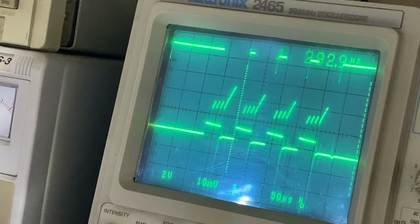So you could do this same modification in the 2000, which this is, the 2100, same power supply, and the 2200 is very, very similar. All you do is find the 40106 near the power supply and tie your transmitter in so it allows it to activate whilst it's transmitting. When the transmitter turns off and goes the other polarity, this inhibits the power supply, so it only operates during the transmit cycle. So that is quick and easy.